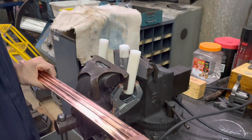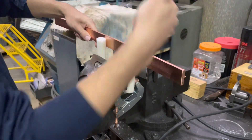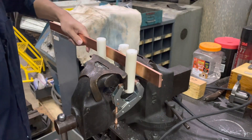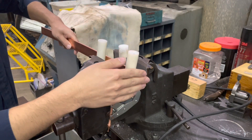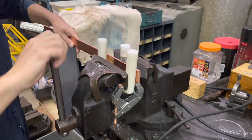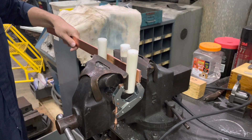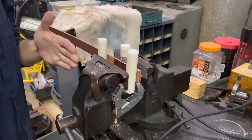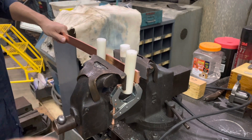I'm going to take my copper bar and put it in the vise so that the hill of the bend is facing away from me. We're going to bend this straight, starting at one end. I'm just going to tighten the vise — get it nice and snug — and then go maybe one quarter of a turn. You're going to see the copper deform a little bit, but you don't want to go over. A little bit goes a long way in this process, and it's better to go slow and take your time.